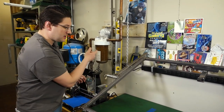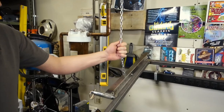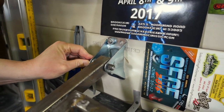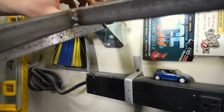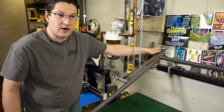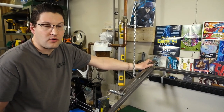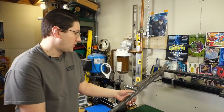The extra sleeve makes a good spacer. Here's my lock. Here's a little of that scrap inch-and-a-quarter tube. An eye bolt with some decent chain goes back to the pivot on the wall. For that wall pivot, I bought wheels from a Tron Midway card rack cabinet — the wheels were shattered, so I found some nice steel wheels. I didn't need the bracket, so I took the wheel off, ground it a little narrower, it fits the Tron arcade game perfectly. I drilled the hole out to fit a three-eighths inch bolt and I got a wonderful wall pivot, pre-nickel-plated — don't have to paint it. It's bolted right into the cement wall with anchors.